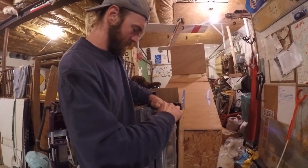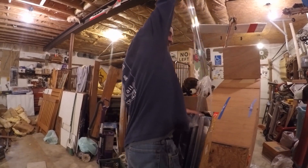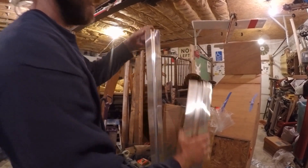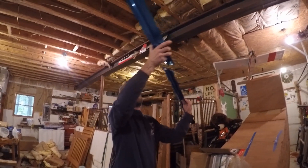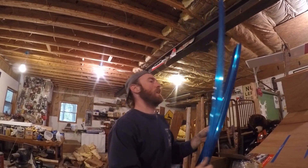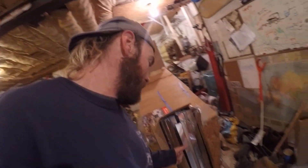These plates use the same technology and principle as that flashing, except it's going to be a whole lot more surface area. We're going to put these up on the ceiling as close together as we can — probably three across and then get into the corners. That's going to extract a lot more heat out of our radiant floor heating water, heat up this metal, and transfer the heat up through the floor above to add heat to the rest of the house and make our system more efficient.